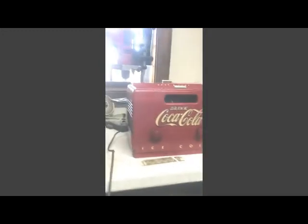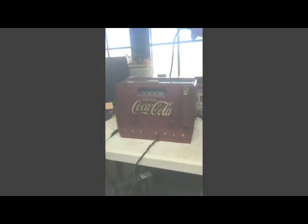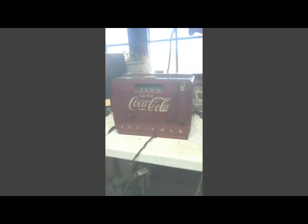And on this one here, I will make a rubber mold to mold the shape of those little fins, and I will see if I can replace the fins on this one over here. And I can fix this cracked and broken cabinet, so from the outside you'll never know it. Anybody that's fooled with these knows how to do that. So we're going to give them a try. I think they'll make two nice radios. They'll never bring top dollar, but I'm not going to sell them anyway, so I'll keep you posted as I go along.